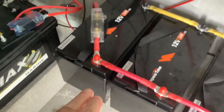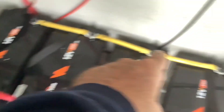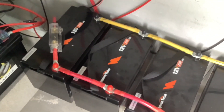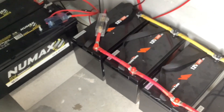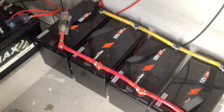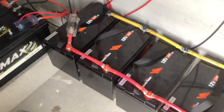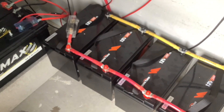When I first started I got a 200 amp hour, but what I didn't realize is you can't mix different amp hour ratings in the same parallel string. This is a parallel string here — all these batteries connected together, maximum of four. So if you start with a 200 amp hour and then need a little more, you've got to buy another 200 amp hour battery. Every battery in a parallel string has to have the same rating. I spoke to the manufacturer, and they told me if I mixed a 100 amp hour with a 200 amp hour, they'd void the warranty on both. They even took back my 200 amp hour battery and gave me a 90% refund after a year, so I converted everything to 100 amp hour increments. These are $350 each; a 200 amp hour battery is close to $800.